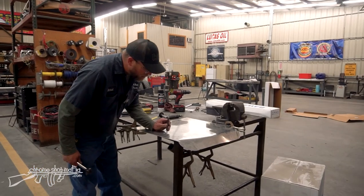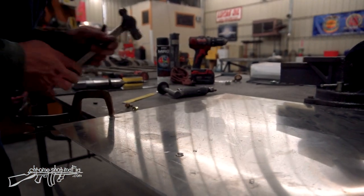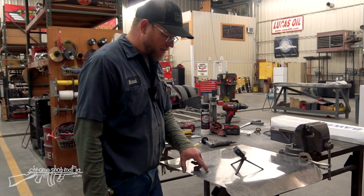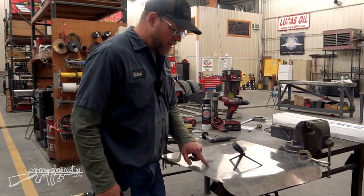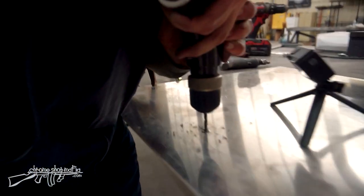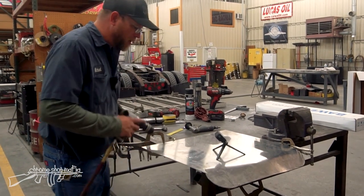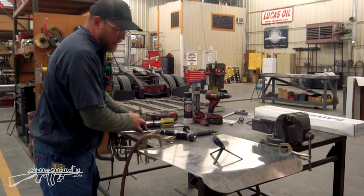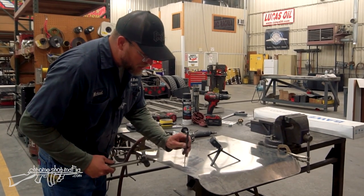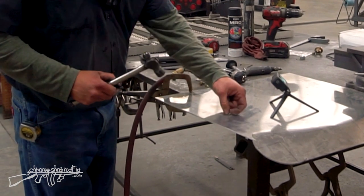Next, I'll take a center punch and just put my index in the center — a place for my drill to start. Now my center point's started on here. The shank of these is 3/16ths diameter, so I'm going to get a drill bit anything slightly larger than that. I've got a 7/32nds in this drill. That went almost all the way through until it started turning, so I should just need to knock the center of it out now. There — my huck head's removed and I've got a 3/16ths hole.